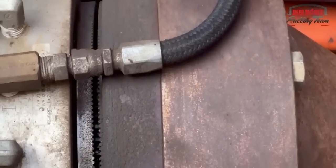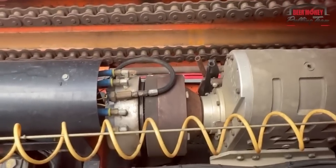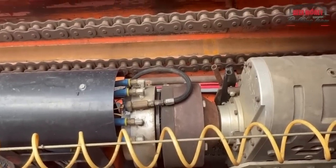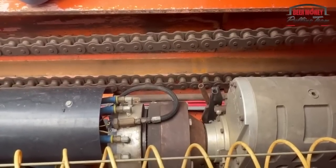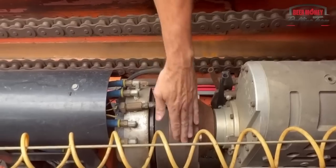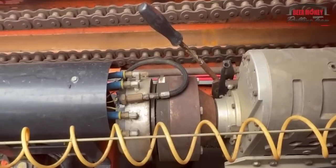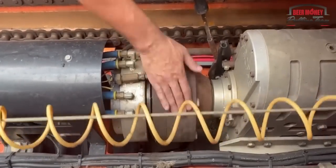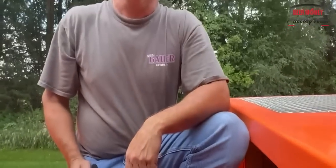If the clutch would slip, you would be cheating the competitor. Actually, the competitor would be cheating the sled because the box would not be coming up the rail as fast as it should be. And you have the ability to change gears too. In our ProFab transmission, it is a 5-speed transmission, and it's as simple as coming up here. We're in neutral right now, and let's just say we choose second gear, and we want to quick change gears and make a fast change on the fly on the track. We can come up here and just as simple as this, we've just gained 20 feet, meaning we've just taken 20 feet out of the run. So it's as simple as that.